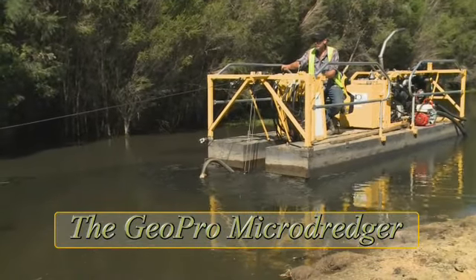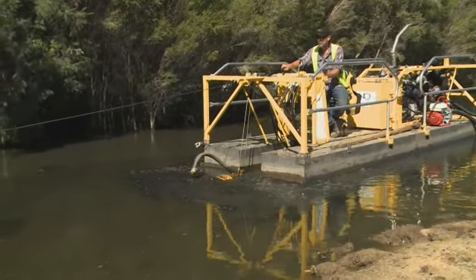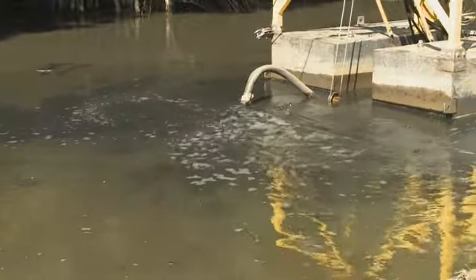You can currently see we've got some pretty black oozy sediment. It's just a slow pass to suck it in. We're in about 400mm of water with about 300mm depth of sediment. It's very, very heavy — we need to cut through it to remove it.